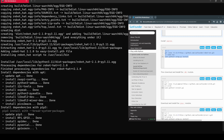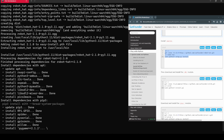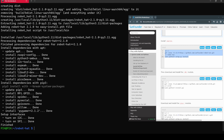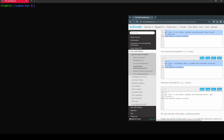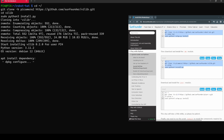Make sure you use the correct board — Raspberry Pi 4. I'm using Raspberry Pi 4 8 GB. Again, if you have Raspberry Pi 5, don't use it until SunFounder gives you instructions. Now it's done. Next, download and install the vilib module. Copy the command, clear the screen, and press Enter. Now it's downloading and installing the vilib module and its dependencies.